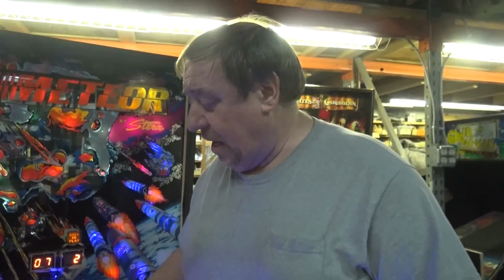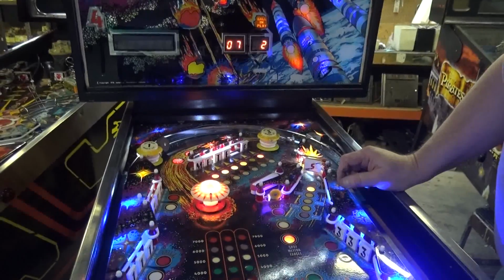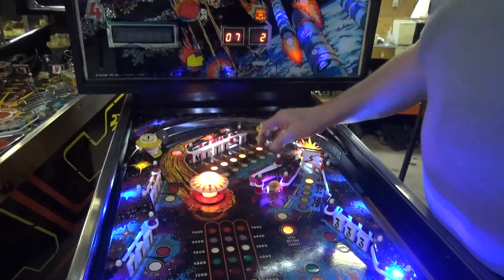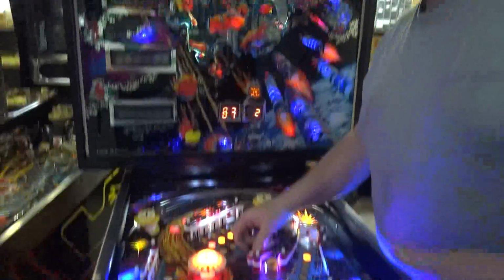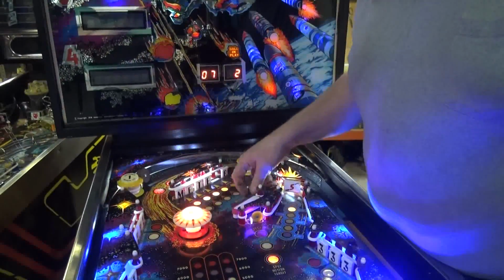So Stern had an option, so you could weaken the flipper. You could put a slightly smaller coil winding flipper on the top. I think it was a 50-50 instead of the 4500. This would be a little weaker, so you wouldn't smash the targets to Kingdom Come. And it was a good idea. They also came up with some kind of a big resistor or something. I saw all kinds of ways to keep these targets from getting busted.